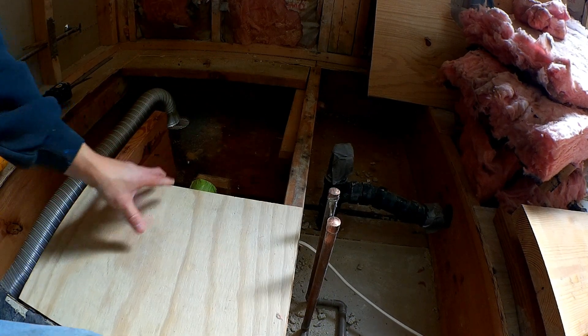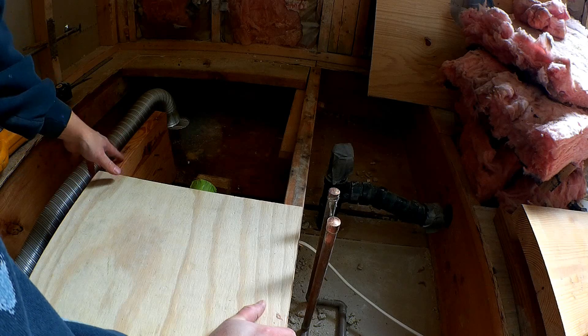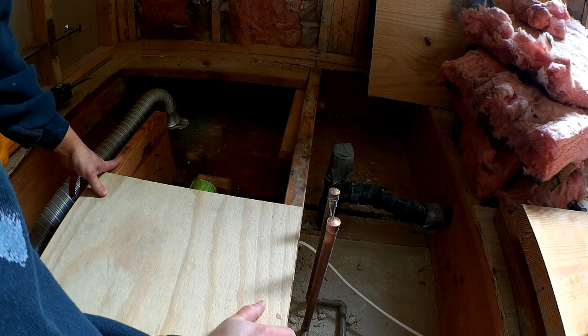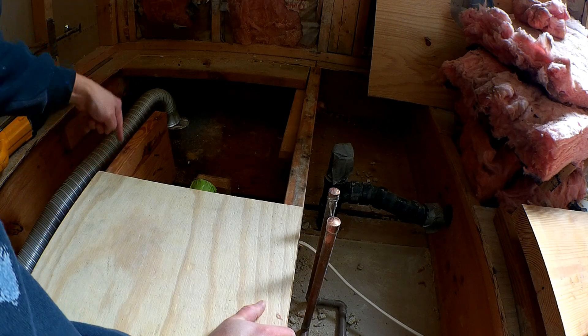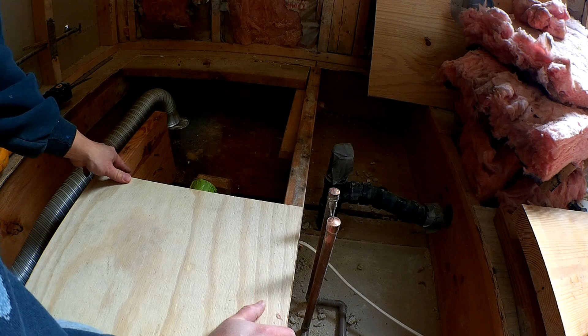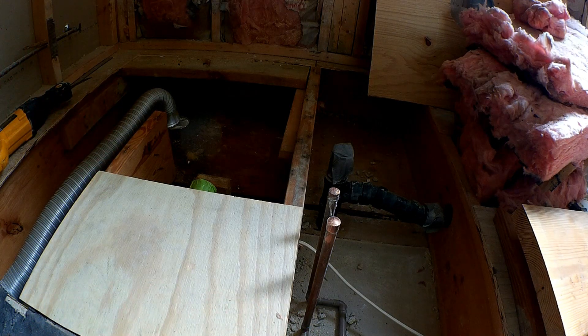When you're trying to lower the floor, you have to meet structural codes for notching joists. Because this is nine inches tall in actuality — even though it's a two-by-ten — one-sixth of nine inches is one and a half inches, so that's perfect. Even so, I'm adding those sister two-by-eights, which gives me my structural rigidity and maintains it, even though I may have compromised a little on these two boards when I notch them out.